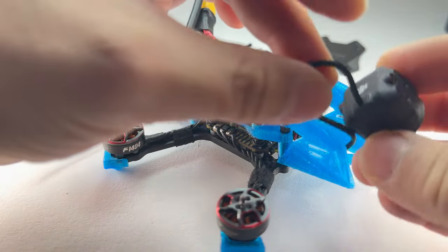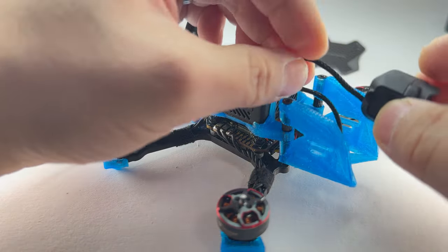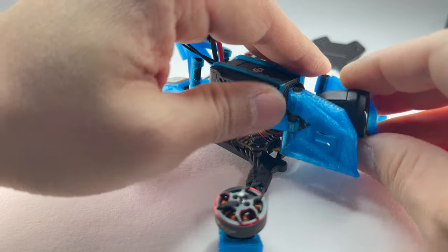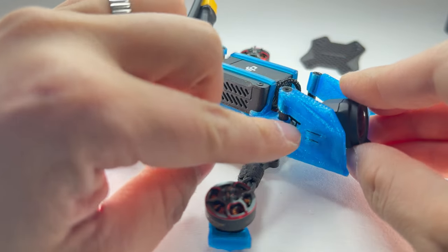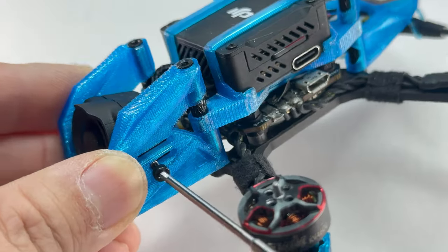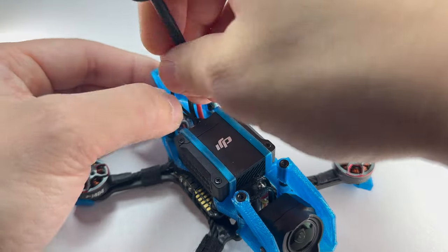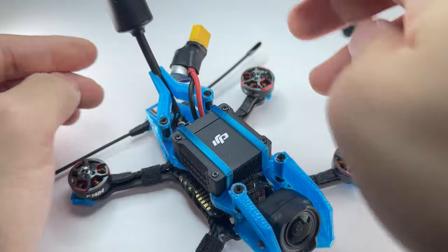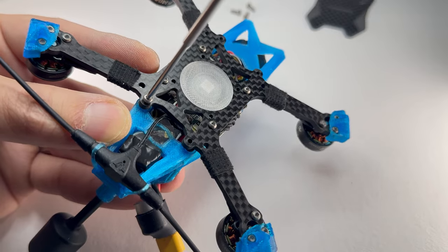You can put the camera in — make sure it's not upside down, I've done that too many times. Look at the DJI logo, coil this wire in, and stick it into the hole at the bottom. This is a universal camera mount; if you're using other types of cameras, just put it in a position where your camera is protected. For the camera screw, just use M2 by 4. The antenna mount is like a C-clip design — just push it in and that's it.